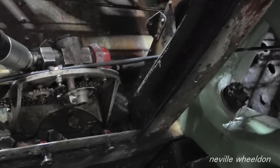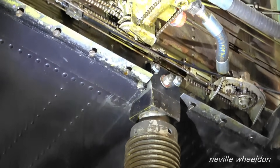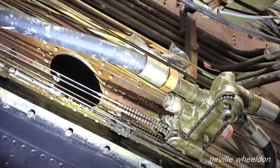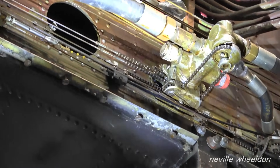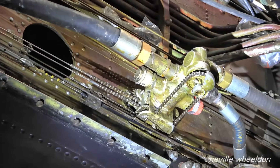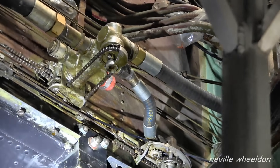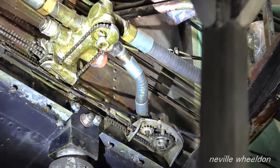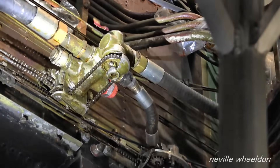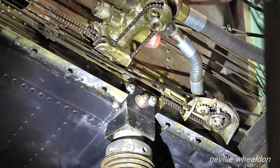You can divert it — you've got two pipes, one each side coming in. In this cock, because there isn't going to be a fuel tank on this side, the only fuel coming in is down this pipe. Ordinarily you'd have a connection there, but it's blanked off on this side which goes into the number one bay. The red one on the other side goes into the number two bay. It's quite a clever little gallery. It's a Manchester design — a really nice little unit if you just want to run one engine from it. But they had to add this second cock on a bit of a bracket, which is a bit of an afterthought for when they put the other engine in. That bracket causes a lot of headaches — it's one of the weak points of the aeroplane design-wise.